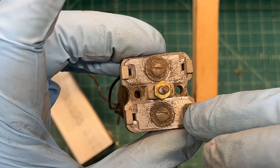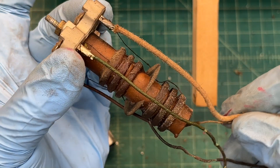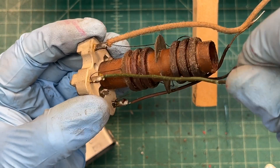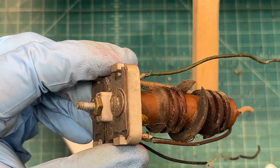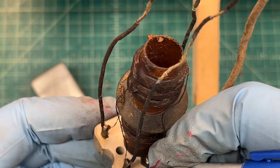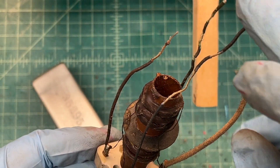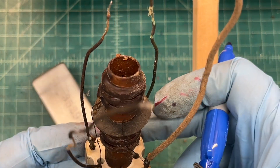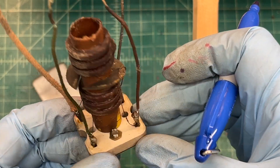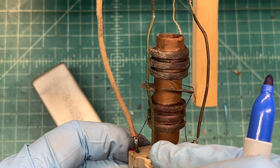Taking this thing out will give me the opportunity as well to clean up on the trimmers. You can see the old lead wire — go ahead and dress this thing up. I'll take time just to denote the primary and secondary, putting a little dot here on the inside. This lead going back to the plate represents the primary, beginning with our B plus.